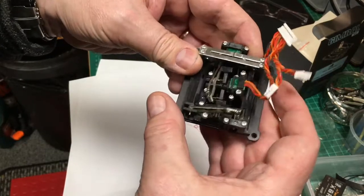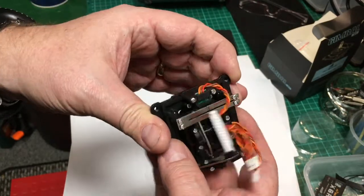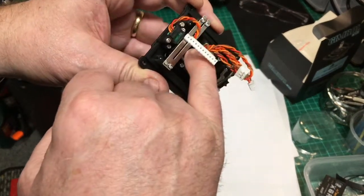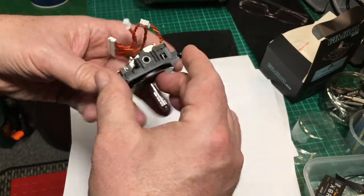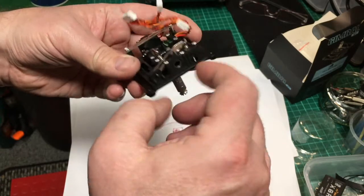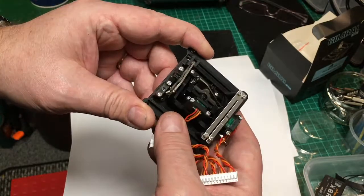On the two-axis gimbal there's one sensor here and one sensor there, and inside the mechanisms as they move there are little magnets. There's like a little arc where the magnet is set inside, so as it passes the front of the sensor it knows which direction it's traveling. There are no moving wear parts — there are bearings and a ball race that's nice and smooth, but they're not spinning fast so the movement should be fine.